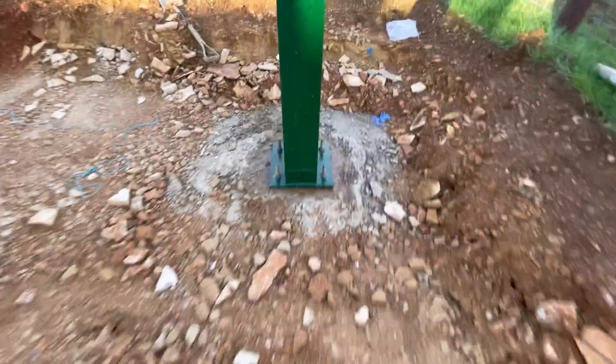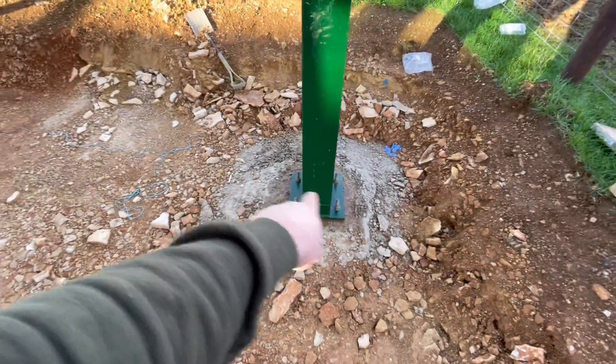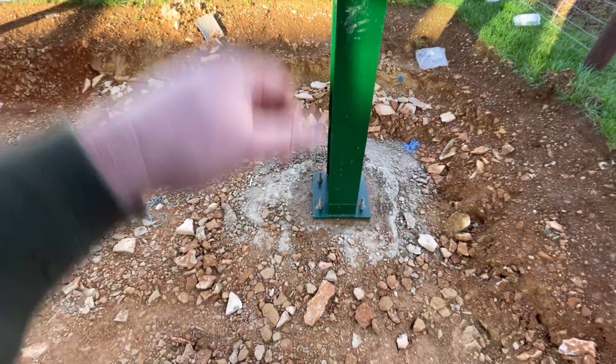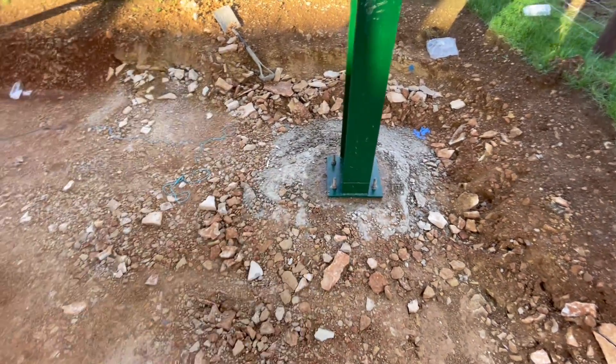Then also we're just going round and marking. Got a bit of chalk, we're bolting some angle iron onto there to sit the concrete panels on top of, because we don't want to concrete the floor then sit them on because all the water comes underneath. So we put the concrete panels on then concrete up to them a little bit higher so the water can't come in.